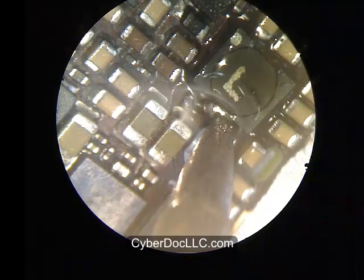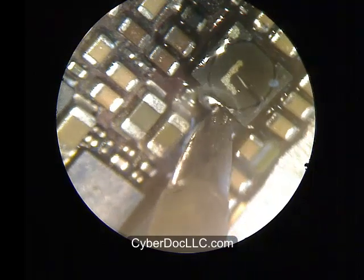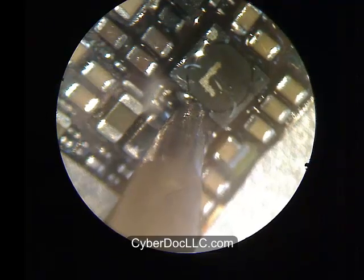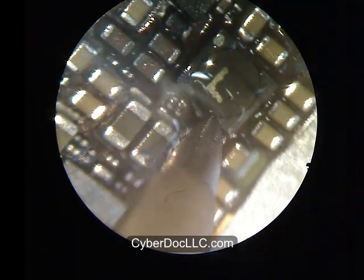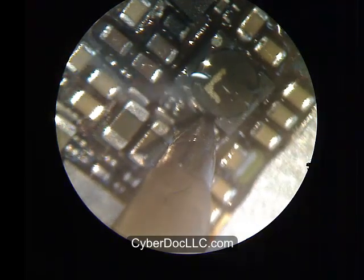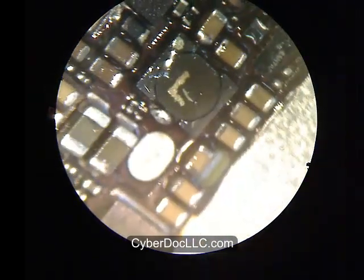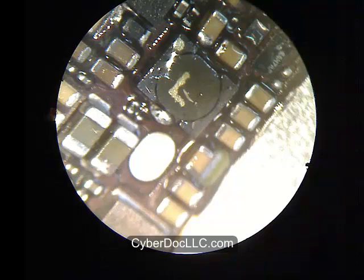You can see how mellow and liquid-like this alloy is because it has a much lower melting temperature. In order for this to work, your soldering iron has to maintain heat of at least 250 degrees Celsius to melt the original solder. Once the two solders are mixed, the combined melting temperature becomes much lower — actually closer to less than 100 degrees Celsius once combined.